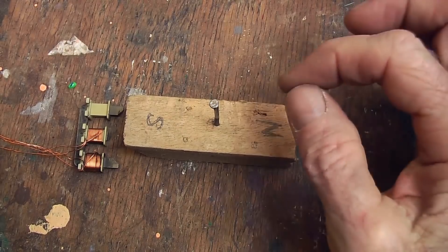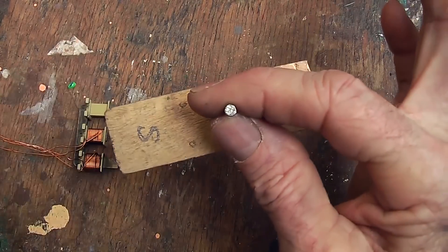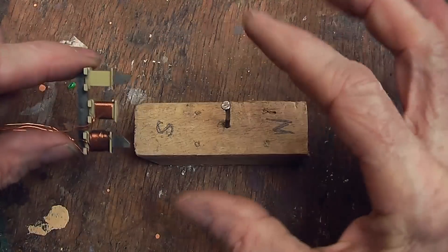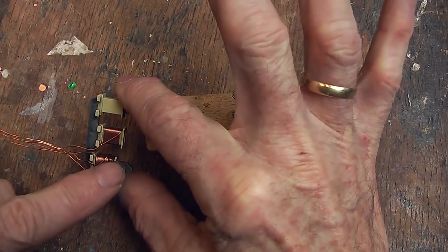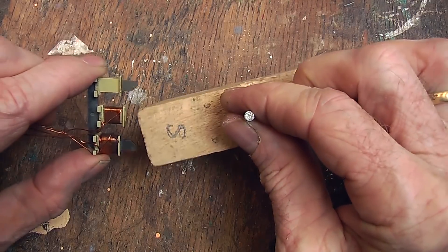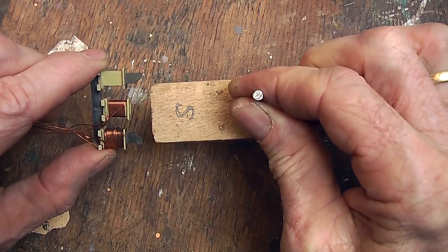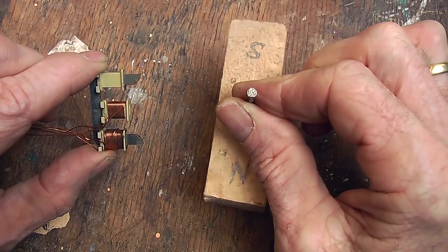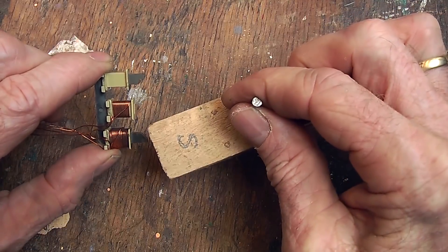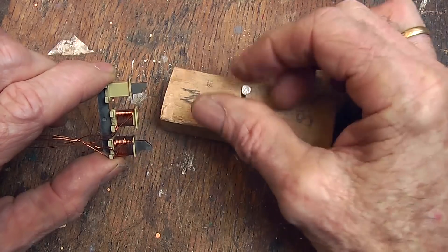Now in a normal motor or a generator, you have a magnet, and the magnet of course has north and south poles. Put a pivot point in the middle and it can spin on the rotor. You take a coil of copper wire, and in the case of a motor, if you apply a current to this, it turns it into an electromagnet. On one phase it will make the two magnets want to pull towards each other, and on the opposite phase it will want to push it away, and similarly with the other end. So by pulsing that, even in a DC motor, it will pull towards that, spin past with inertia, and then pull through - and that is what makes your motor spin fast.